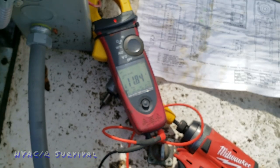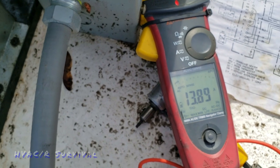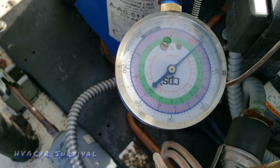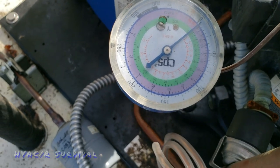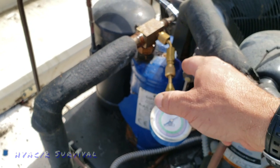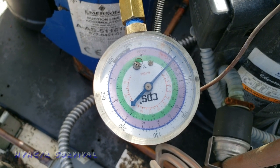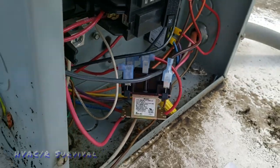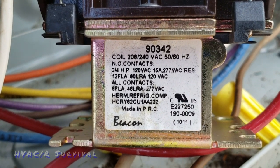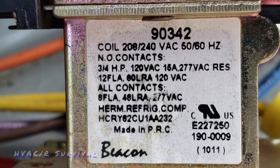Amp draw is 11. Shut off right on about 20, jump right to 16 - holding right in there at a couple pounds. That increment is 5-pound increments on this gauge. Something just changed internally but you do have a direct vapor injection on this. She's holding pretty good there at about 12 pounds. The only thing I could see that was not right is this right here - your interlock for your electric strip resistive circuit is at 15 amps, so we're right at the top of the border there.